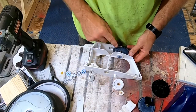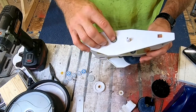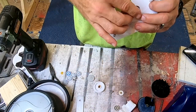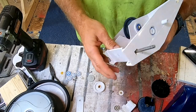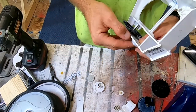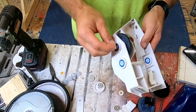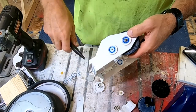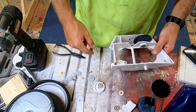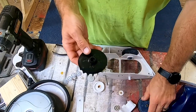All right, so we still have our case — two bearings already replaced, we're in good shape. This goes on the outside; there is a bearing right there, let's get it out. Get the bearing in there the correct orientation. We got one right there. Oh yeah, they're just popping out now. Replace the bearing — looks like I need a clip right there. Put the clip in — simple little C-clip goes right into the groove so it does not come out. Oh, that sounds so beautiful.